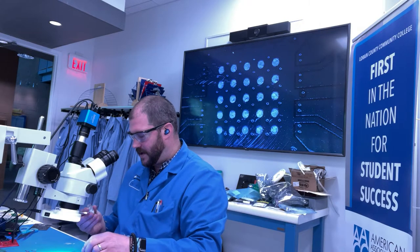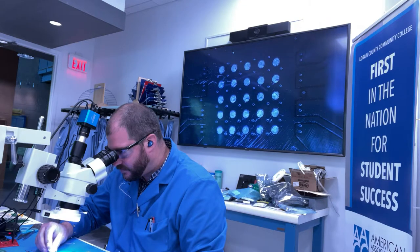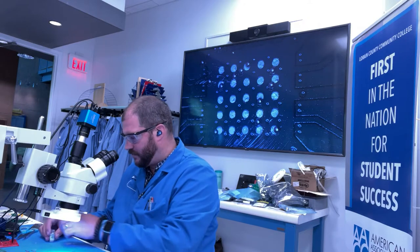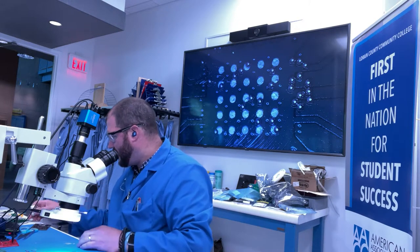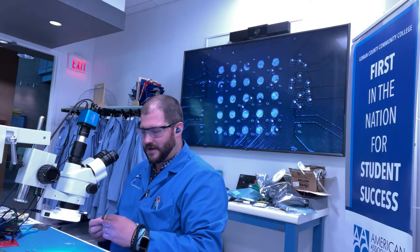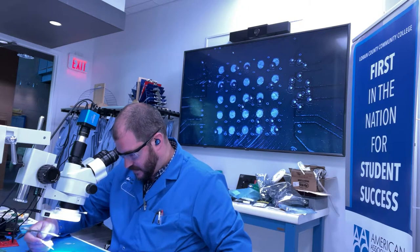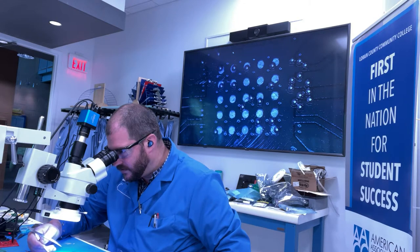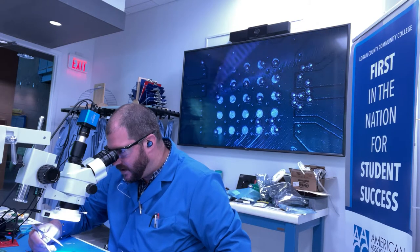That's going to give just enough to fill in the interposer parts without leaving a tremendous amount extra. Next I'm going to apply some solder balls. This chip takes 0.55 millimeter solder balls. So let me put some of the solder balls onto the board — you can see some of them are sticking down to different places. Now the fun process — I do actually have a stencil, but I'm doing just the central parts here. Normally, if you have a stencil, you load the chip into the stencil, align the interposer up to it, and drop a truckload of balls into the little stencil frame. Then you shake it all up.